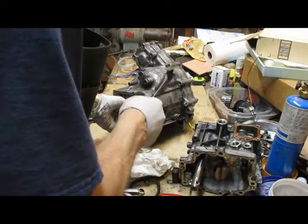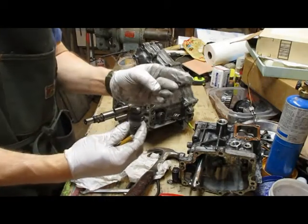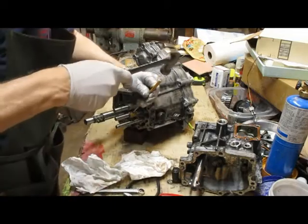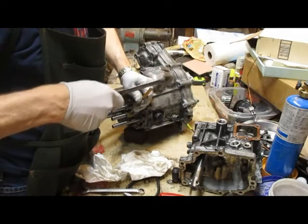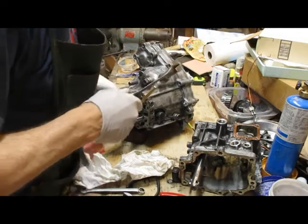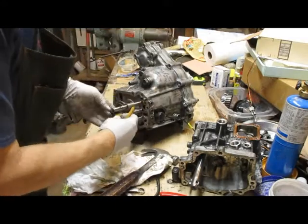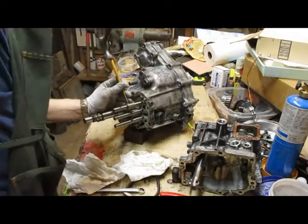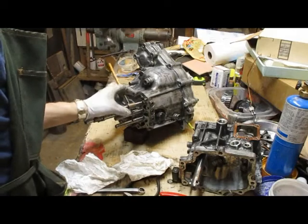Any kind of support underneath it at all is better than nothing. There's the one — it's a little split ring. You can take off the second one. Just don't hit it super hard; just kind of tap it until you can get it going and get your finger around it. You can support the shaft — I have had some bent shafts; I don't know if it was caused by doing this or not, but I take a chance. Just give it a little support.